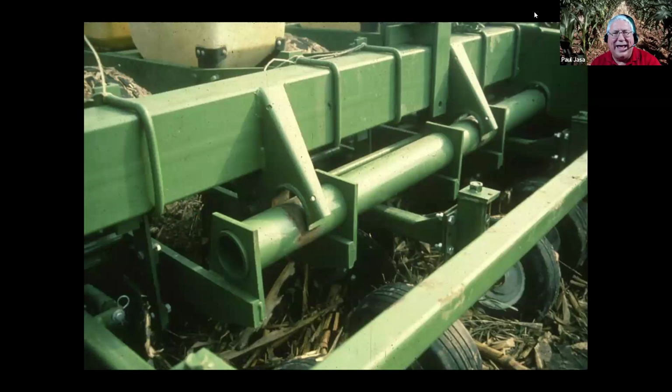But at the same time, we've got to do a math problem. As the springs are pulling down on the planter unit, they're pulling up, taking weight off the toolbar. Now, this is an extra set of springs here. That's Sukup ridge gliders up front, clearing the ridge in a ridge till system for irrigation. They're looking for 200 pounds per row. The heavy-duty down pressure springs in this Deere planter, we're looking for 300 pounds per row. 2 plus 3 is 500. 500 times the 6 rows is 3,000 pounds. And that planter toolbar did not weigh 3,000 pounds. It's lifting it up off the rock shaft. So again, we've got to start thinking about how many things we have going on the ground, how many springs are there, and do that math problem.